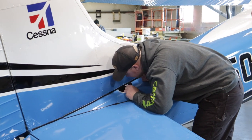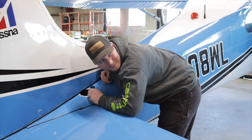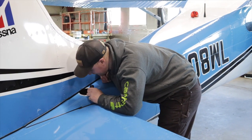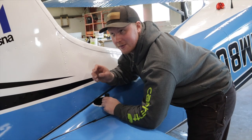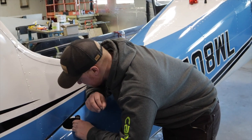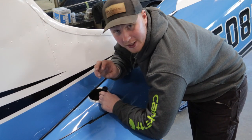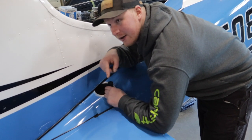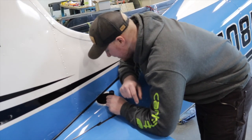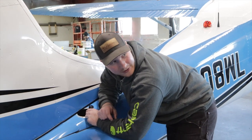Okay, I see a problem here. I've never seen it before, but one of these gold — looks like a brass — turnbuckles on your elevator cable has a crack starting down it on the threads. So yeah, that's not good. If that lets go, you're dead. It's a pretty easy fix though.